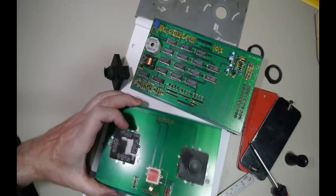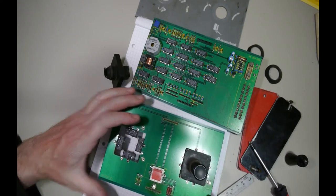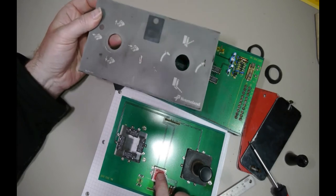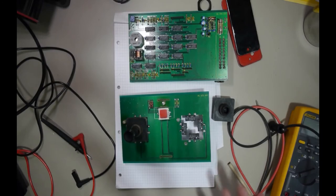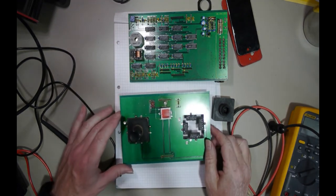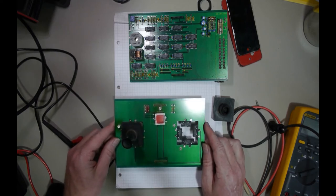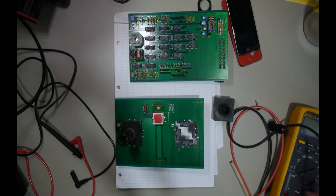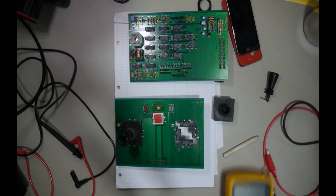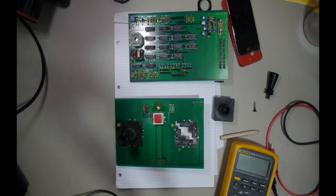And then one stop button according to the front panel. So yeah, one stop button and one LED. I just had a thought, before I desolder these micro switches, I should just buzz them out so that we know what's what in terms of the circuitry. Now, there's a ground plane. Well, I don't know whether it's a ground plane, but there's a copper pour on this PCB. We'll assume it's ground. It doesn't have to be, but we'll assume it's ground.